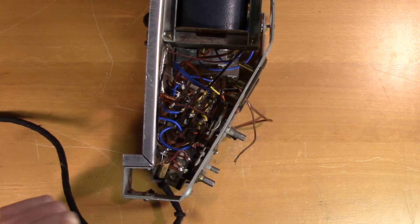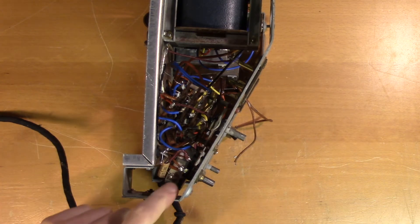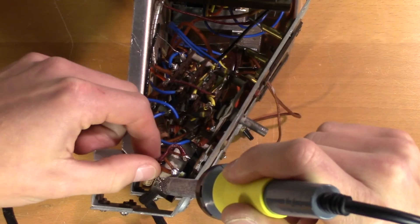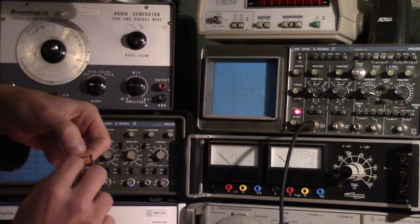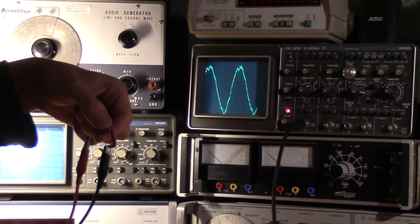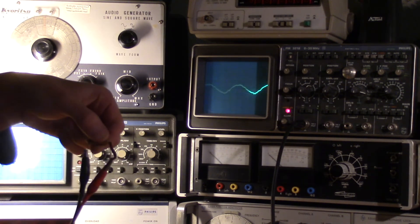So now it will be interesting to see how these old wax capacitors are shielded and if they're installed correctly. We'll be taking a look at this capacitor because this has an obvious preferred orientation. This terminal is connected to the gain adjustment potentiometer, so we have signal on this node, and the other one is connected to ground. In this case ground is the lowest impedance net, which means that this terminal should be connected to the outermost foil of the capacitor to shield this signal node. Let's start by connecting it what we think is the wrong way — high impedance oscilloscope input on the outer foil. About 400mV peak to peak. Assuming this capacitor has a solid metalized outer foil, we should get significantly less disturbance when we flip the polarity, if this capacitor was installed correctly. And it was.